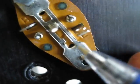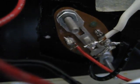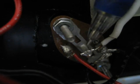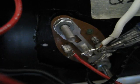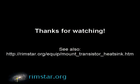It actually says B and E right there if you're not sure. Here's the power supply again — there's the transistor. The base is this red wire right here, soldered to the piece sticking out. There's your collector — that's the white wire. And the emitter, a little harder to tell because it's black on black, is this black wire right here, soldered to there. All complete.